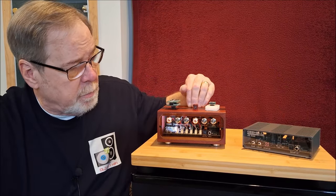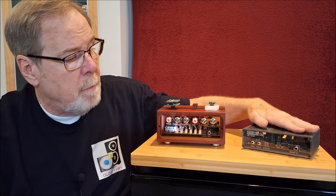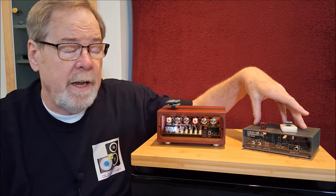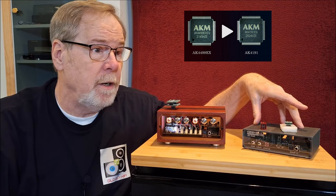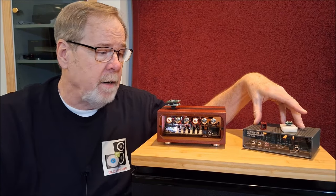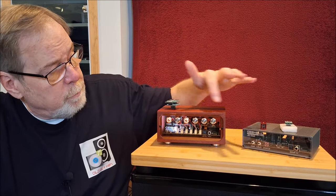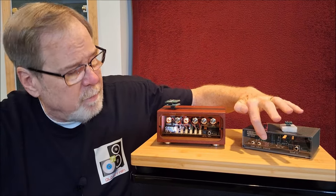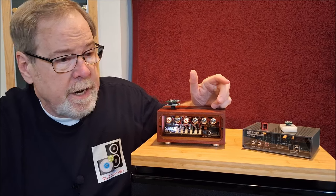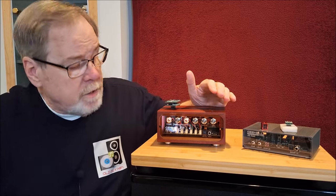The reason is I've had the J2S longer and the J3 Pro is brand new — I just got it last week. The good news is they share an awful lot in common. Both are socketed boards so you can do op-amp swaps. Both use the AK4499EXEQ plus AK4191 companion chipset for D-to-A conversion. The difference is the J3 has directly accessible inputs on the unit, rather than the LED layout of the J2S where you push in to indicate your inputs — once you get used to it, it's really simple.